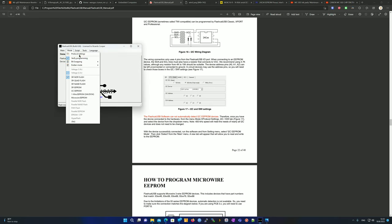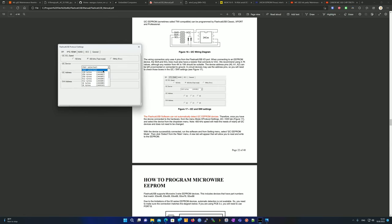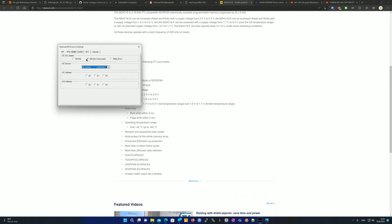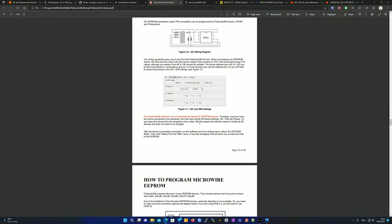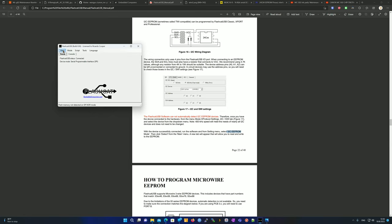To configure the software, go to Mode > Protocol Settings > I2C/SWI, then select the device from the list — it's the 16 kilobit chip, the 24C16, which is 2 kilobytes. Leave the address pin checkboxes unchecked, because checking them will throw off the flash layout. Set the speed to 400 kHz or 100 kHz — your choice. Then go to the Settings menu and change the mode from SPI NOR Flash (the default) to I2C EEPROM.